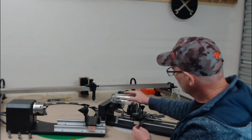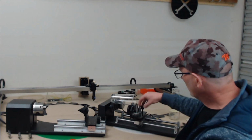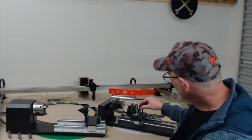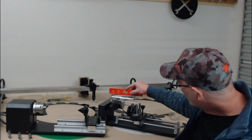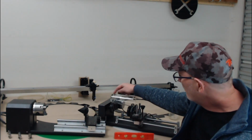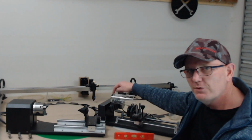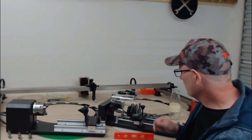With the wheel attachment, the glass is always on the top, and you can lower and heighten the rotary wheels at the front end of the glass until it is level, which is a good option for engraving on sloped objects. So even with this attachment lowered all the way down, this is still not quite level. We're out by a few millimeters there. So what you would need to do is put a rubber band around there and raise it up off those back rollers. And by doing so, you then need to calculate the outside diameter of the rubber band so that you could work out your steps per rotation effectively for that sized object.